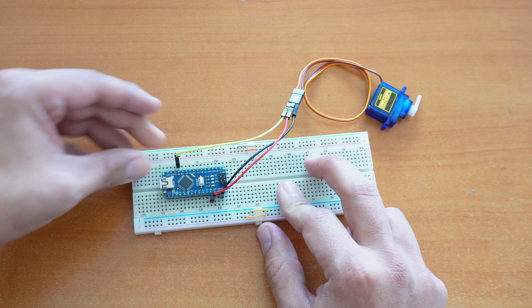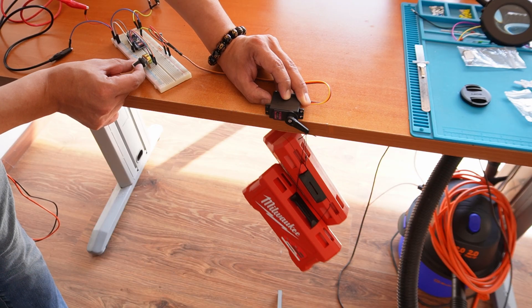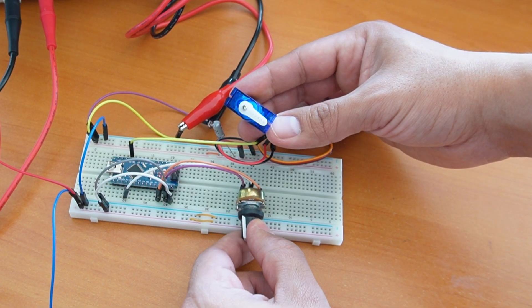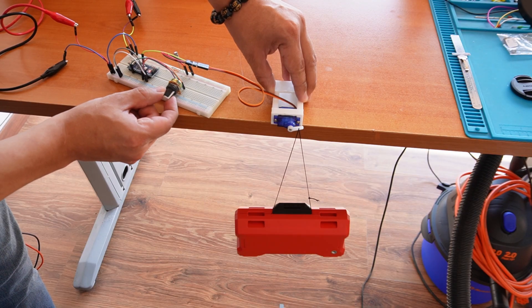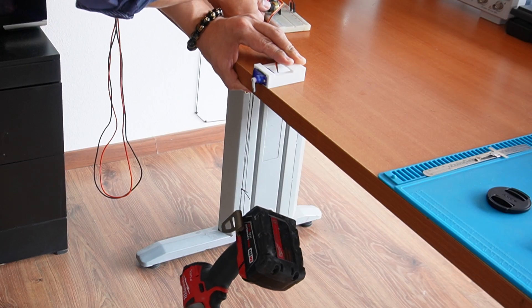Now let's summarize the pros and cons of using a servo motor. Pros: they are very easy to plug and program, very practical, no need for an external driver like other motors require, and they have precise rotation. Cons: no position feedback on standard servos, limited torque and range, and less holding torque compared to a stepper motor, depending on the version.